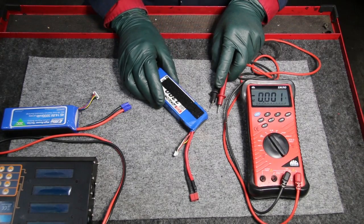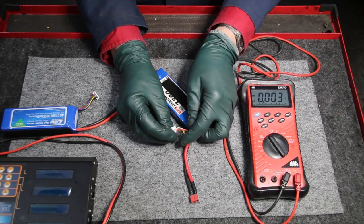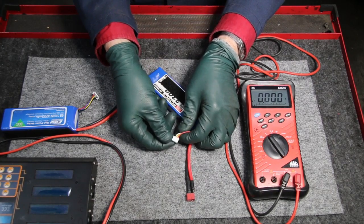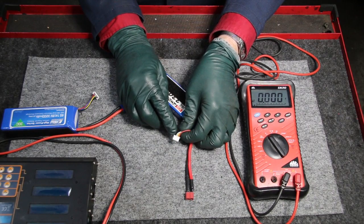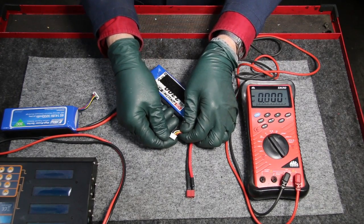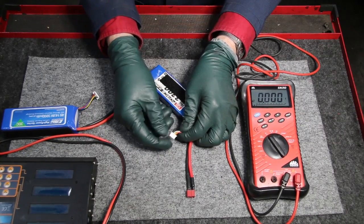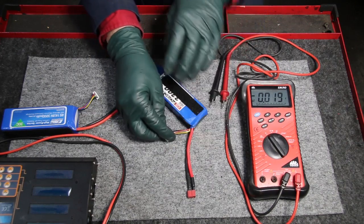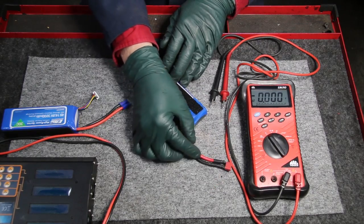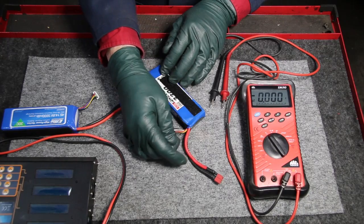Let's start with this three-cell 3300 milliamp battery pack. Note here it has a small connector called a balance lead. This is also a clue that it's a three-cell, because it has your common ground and a power lead for each one of the three cells. You can test your battery through this connector and also balance charge it. This is the output lead that goes to whatever you're powering — notice the size of the wires. This is a high-current-draw battery, so it has some real oomph to it.